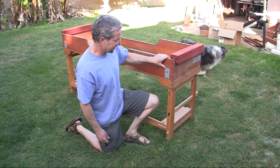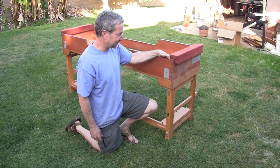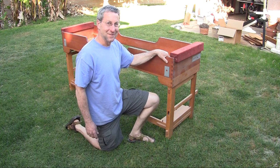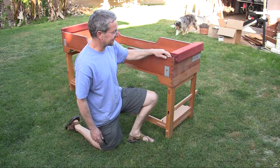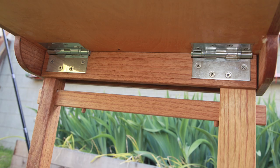When I was building this bench I had always loved dovetail joints, and I figured before I bought a nice dovetail jig I should at least make one series of joints by hand — so my door box was my 101 lesson in dovetails. Kevin's a little shy about sharing his workmanship, but not only did he dovetail the ends of his bench, he mortised everything in flush including the door hook, the hinge template supports, and the butt hinges on the legs too.